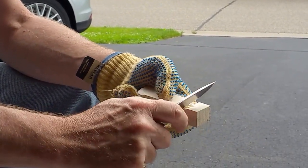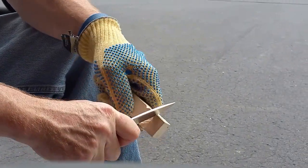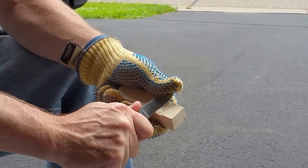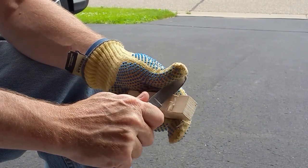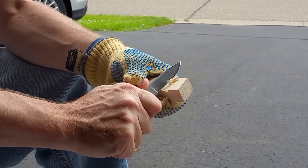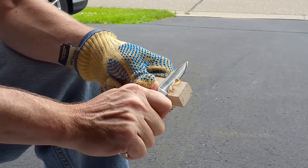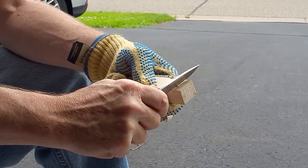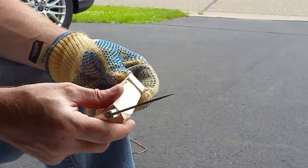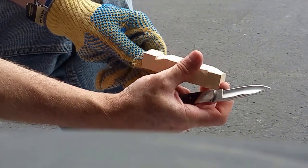To clean it up, you just go again 90 degrees, and you just put a little bit more of a score on there, go back, and you can see that we have our push cut being pushed all the way to the stop cut, and the stop cut has now made a nice line.